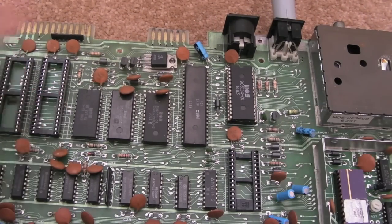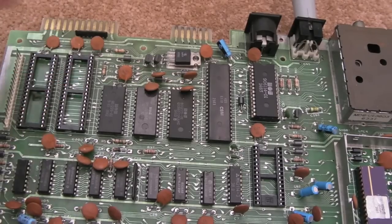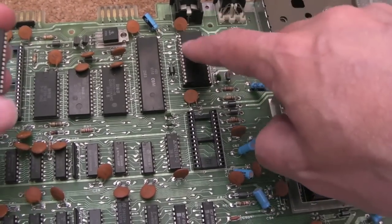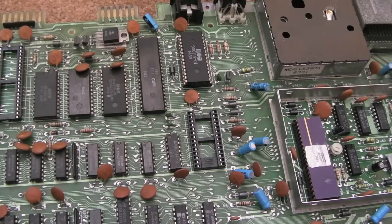You know, if you get a black screen, you could just remove them completely. If you've got no frame of reference, you don't know whether one of them's giving you a black screen or both of them might be faulty. So just remove them completely — remove the SID and see what's going on from there. But in this instance it was the PLA, and that ridiculous temperature was the clue. Thanks for watching, I'll see you soon.